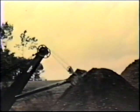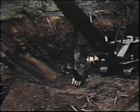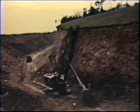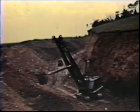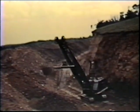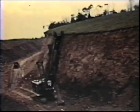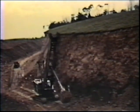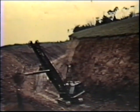With a depth of overburden about 30 feet, the 54B could strip a cut about 30 feet wide. That was sufficient room for a small 3/4 yard or 1 yard coal shovel to follow behind and load highway type tandem trucks. This cut here looks as though it's the last strippable by this machine, as the overburden is getting deeper.